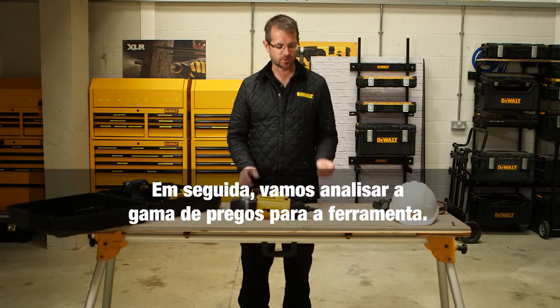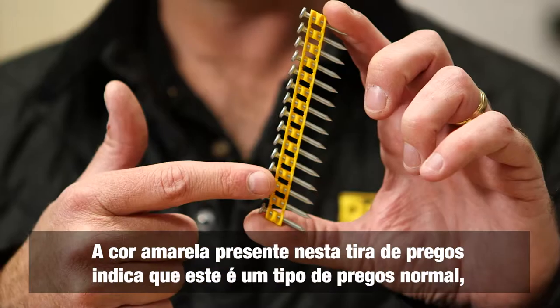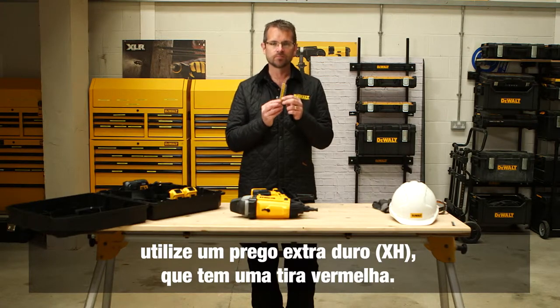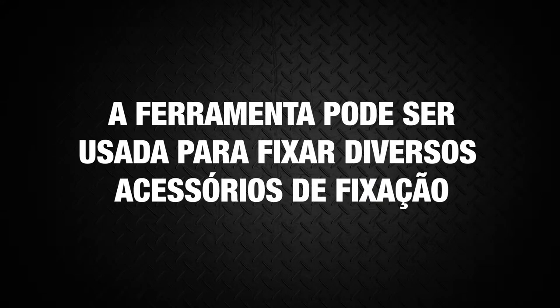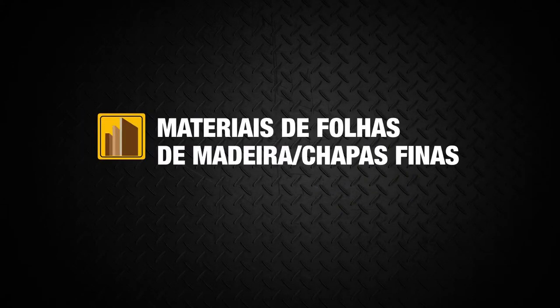The nail range for the tool starts at 13mm and goes up to 57mm. A yellow collated strip denotes a standard nail, suitable for standard concretes and light masonries. For particularly hard concrete or fixing to steelwork, use the extra-hard XH nail, which comes in a red collated strip. For extra high shear capacity a thicker HD nail with a 3.7mm diameter is available. When choosing the correct nail length, add the embedment depth plus the fixture thickness. The tool can be used for steel brackets, wooden battens, membranes, wire mesh, and thin sheet materials.